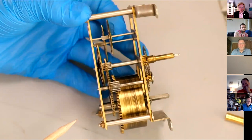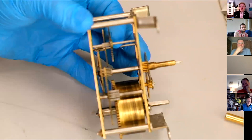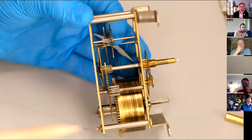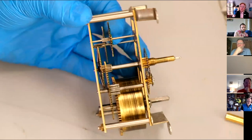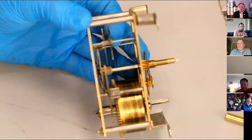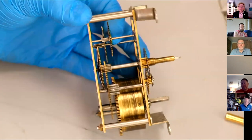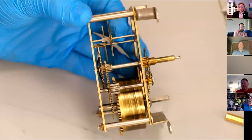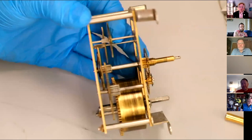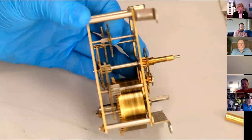Okay. Now, you might say, well, wait a minute, Matthew. Why bother letting the spring down with this ratchet? Why don't you just let the clock run down? Well, you could. I'm always slightly dubious about that because we don't know what the condition of these bearings is. There might be something already broken. I don't like letting it run through like this, and also, you'd never know that it's completely run down anyway. So what I prefer to do,